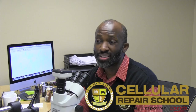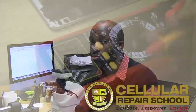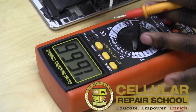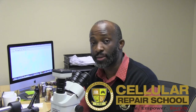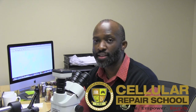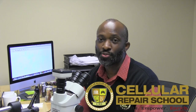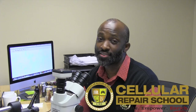What we're going to do in this video is show you how to check that before you actually get started. There's a way you can check to see if your fuse is actually working — it involves having a multimeter. You put it on the continuity setting and check to see if that fuse is still good or not active. If it's not active, you either need to jump it or replace it. It is definitely repairable, but you have to know what you're doing, and to avoid doing it again, you need to understand what caused it in the first place.